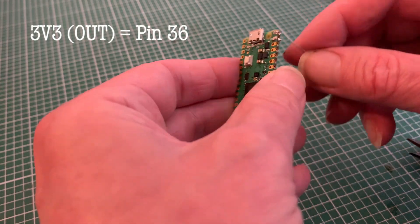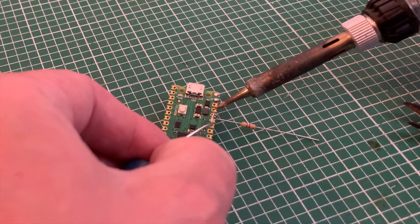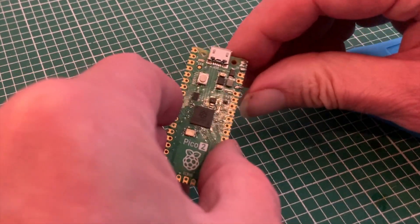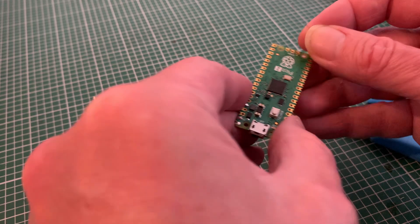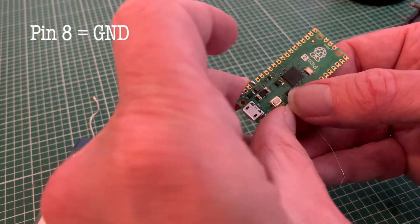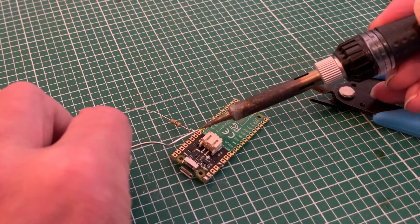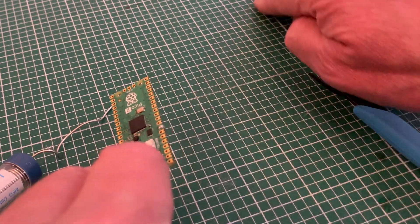The next pin clearly shown as connected is pin 36, the 3.3-volt output. Once again I'm using a little bit of wire from that resistor — there's plenty left so I should be able to do all my pins and still have enough left to use the resistor on another project. Slightly hidden away on the bottom left of the schematic is the ground pin connection, and this can really be to any one of the ground pins on the Pico — the ones with the rectangular ends. I've chosen pin 8 as it's in the corner of the shim, diagonally opposite to VBUS, so I'll have solidly soldered connections on both sides of my board sandwich rather than relying solely on the double-sided tape.